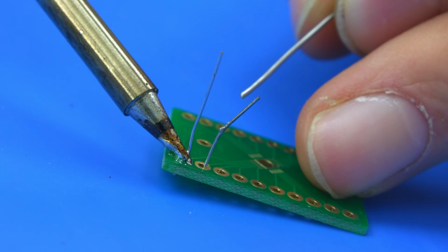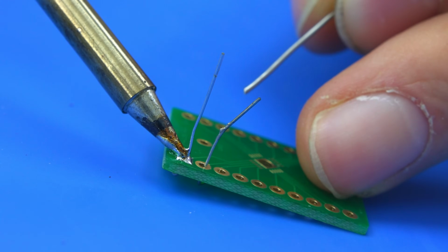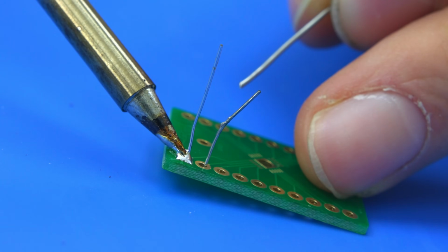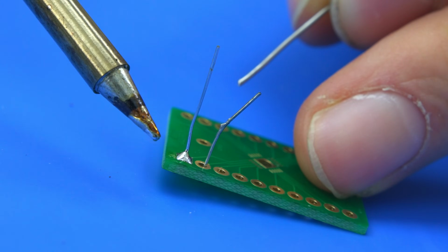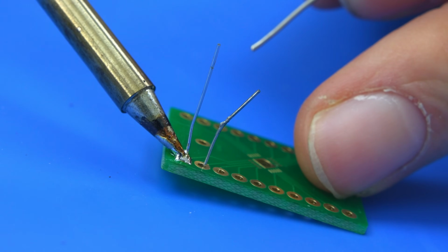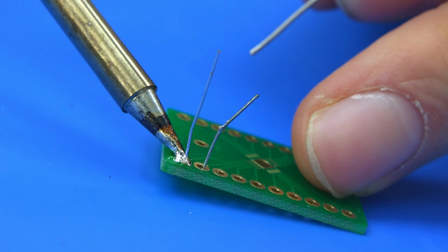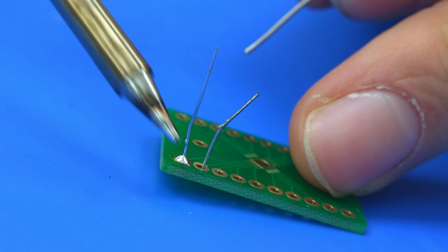And if we go back and warm it up and come off again, you see it's still nice and pyramid shaped, if you will. And you can keep going back and forward for a good while. And eventually, if we just leave on this, you'll find that the solder will start sticking to the iron and not the joint once all the flux is burnt out. So as we start doing this, it should eventually, as the flux gets burnt up, stick to the iron and not the leg. And you can see with this, it's lasting a very long while. So I'm trying to purposely get it to actually stick to the iron and become dry. But this is, like I say, my best leaded solder. This is what I found works the best.